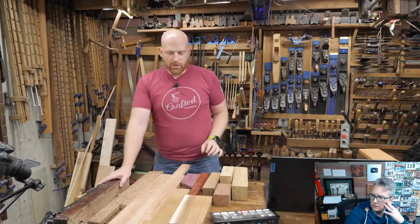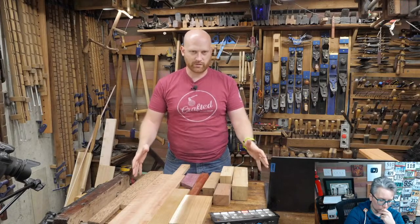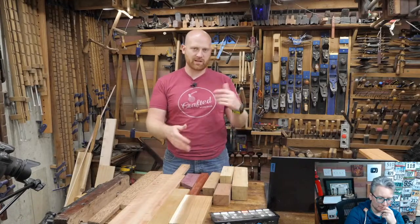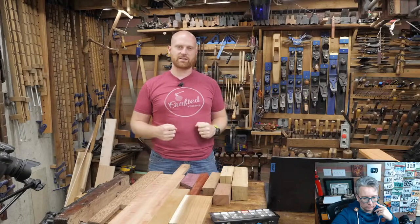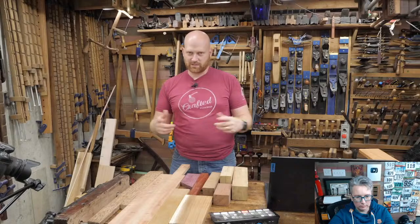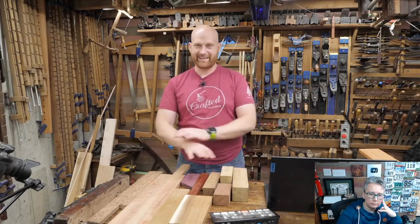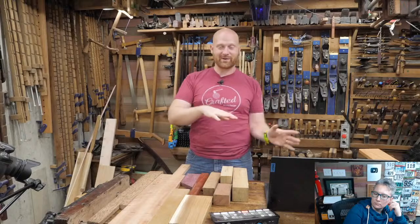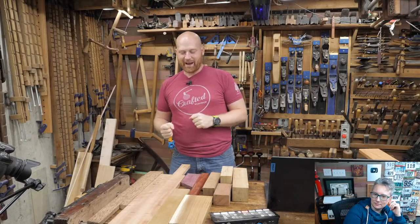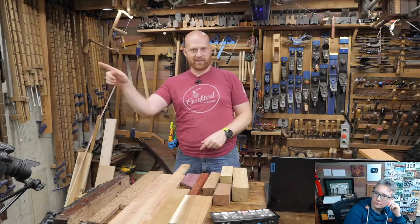The next thing to ask yourself is: what do I want the wood to look like? First, is it structurally capable — is it hard enough, and is it workable given ring versus diffuse porous characteristics? Then, does it look good? If I put the exact same boiled linseed oil on all of these woods I get wildly different colors. Every finish out there imparts different coloring, and every tree accepts that coloring differently. I can often say a certain finish on white oak will give you this result, but a slightly different white oak might give a slightly different finish.